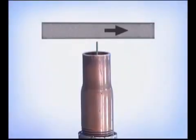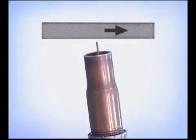Try holding the gun nearly straight up and down, maybe angled very slightly back towards the weld. When you maintain the recommended wire extension and a uniform travel speed, the molten filler metal will stay right up there. On an overhead, you need to keep the base metal and weld puddle from overheating.